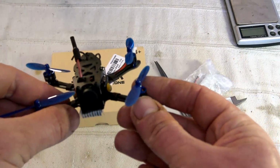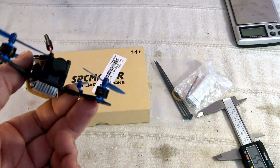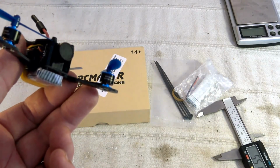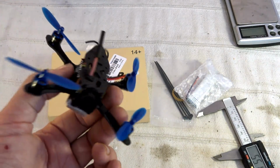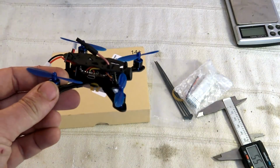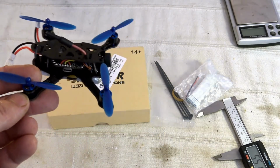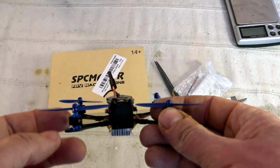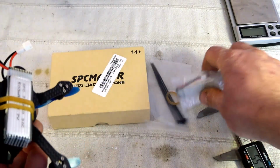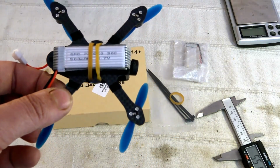This one has maybe a little bit thinner body compared to the Ladybirds, but no real problem to find compatible ones. The motors, as you can see, are 0705 15,000 kV, and they won't work in 2S. Whatever, the ESC won't allow it with only 4 ampere to be run with a 2S setup. For example, the A100 from Huachin will be 6 ampere. Maybe there is a small hope it can be run in 2S configuration.